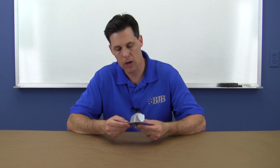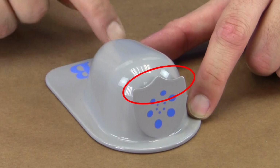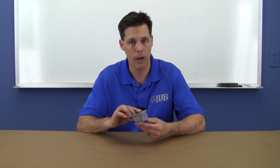One of the first tasks to do in preparation for mold fabrication is to determine which side of the part to mold first and how you plan to orient it. Our fire helmet is fairly flat on the bottom, and the top is the cosmetic surface we wish to display. We also look at the geometry and the features that may trap air in the part if it's oriented the wrong way. For example, these sharp points on the badge would be best oriented downward to avoid trapping air.